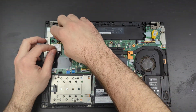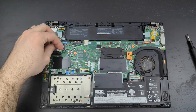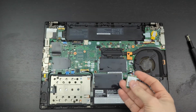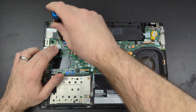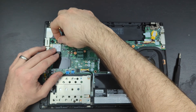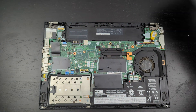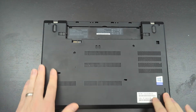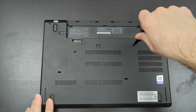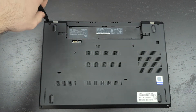While in here I'm also going to upgrade the Wi-Fi card. It just has a stock AC Wi-Fi card, so I'm putting in an AX Wi-Fi card — an AX210 — which will make it a lot faster. It's pretty easy: just put it in and screw it back down, but be careful with the Wi-Fi antenna connectors. Line them up and push down but don't force it. Now we can button up the laptop: put the screws back in, tighten them down, reconnect the external battery, and we have a fully kitted-out Libreboot T480.